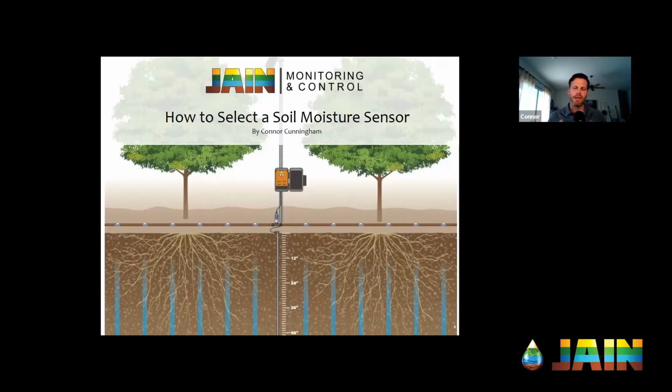So you create this atmosphere and you create a pressure inside the probe. As the soil dries out and as the plant pulls the water out, it creates more pressure inside that probe body. And so that pressure reading can then be equated to either dry down, field capacity, permanent wilting point, or even the pull of the plant pulling the water through that probe body. So I think these are measured in centibars. Is that right? That is correct.